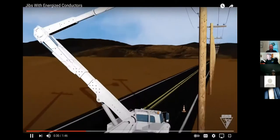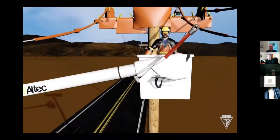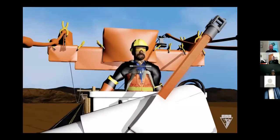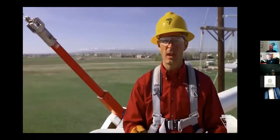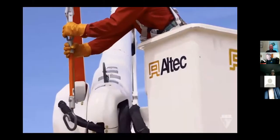But why is this important to have an insulated jib? To explain this, let's take a closer look at the truck. The upper boom is only insulated between these two marks. So if an uninsulated jib contacts an energized source, this whole area becomes energized. If we were to accidentally make contact with a grounded object, it would create a second point of contact, which could cause serious injury or death. So you should use a live line tool like this link stick to provide isolation from the energized source.